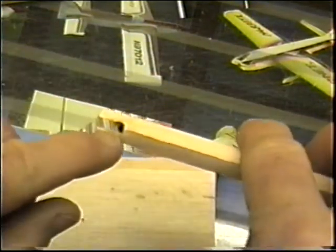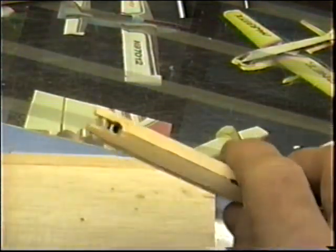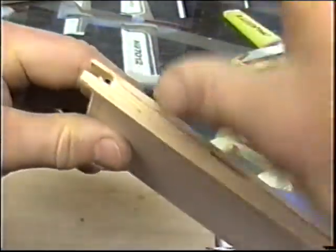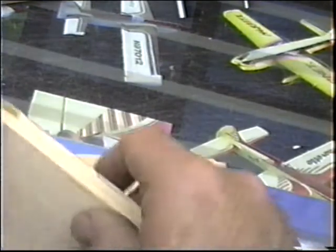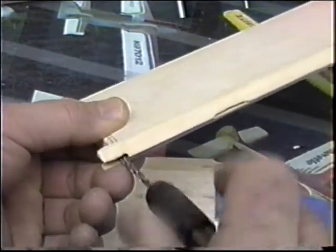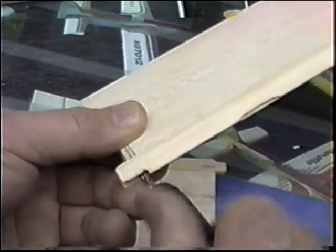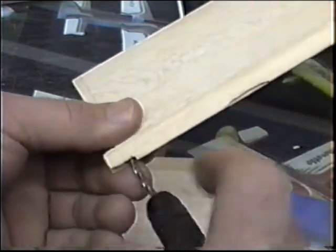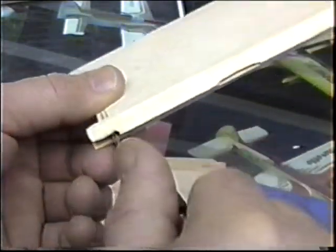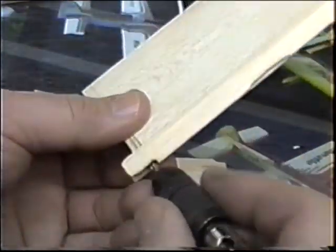And of course, in the course of doing this, you always wind up getting a little CA in there. Well, I went to push this onto the horn and it doesn't want to go. In the past, what I've done is go over to the drill press, put it on no speed, and just turn the chuck. Well, that's one way of doing it, but an even better way, I think you have better control, is I have a little tap handle, and obviously a couple dollar tool, but I can go in there, and the slower you can go, the better. I don't want to drill out the back of the part, and I don't want to make a lot of extra clearance, but you can feel I've got a little bit of CA in there. And now the horn, never put it in a drill press and then hit the switch, or you'll be eaten apart.